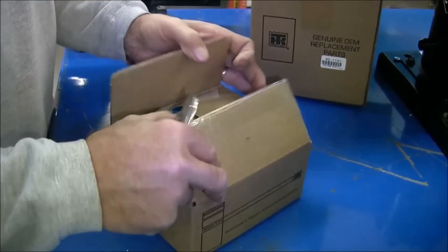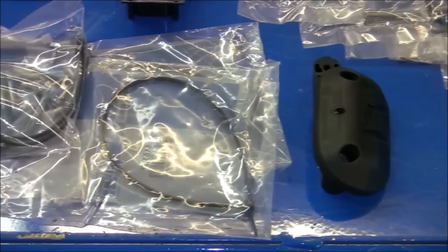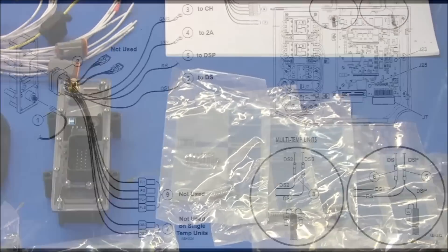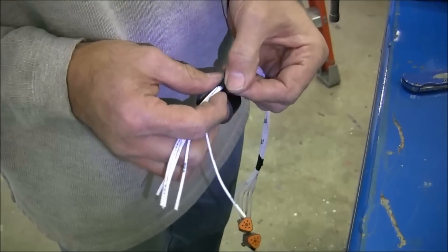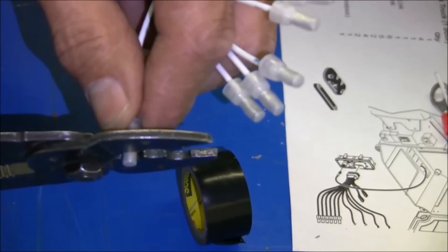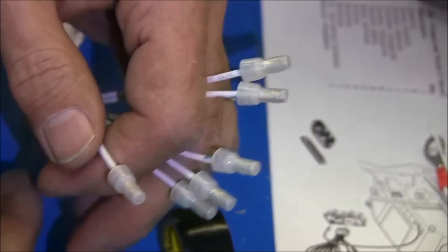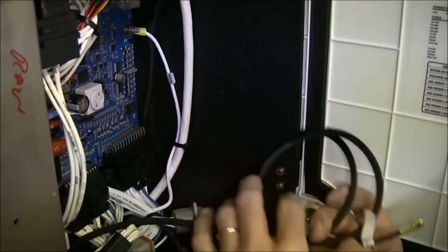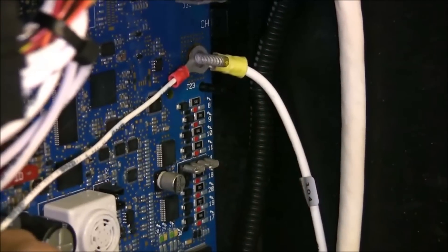Open up the boxes containing the wireless door switches, magnets, fasteners, wire caps, splices, coordinator module, and interconnect harness. Prepare the interconnect harness by separating out and attaching a terminal splice cap to each of the wires labeled FI1, FI2, FLR, FLS, DS2, and DS3. Move the antenna cable and attach the GND ring terminal to the CH ground stud J23 on the controller board.